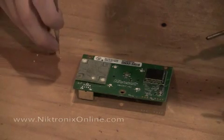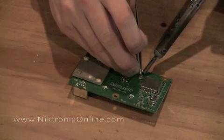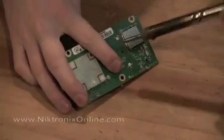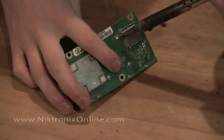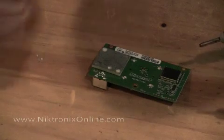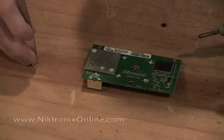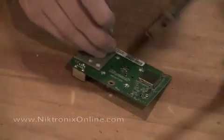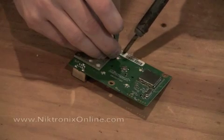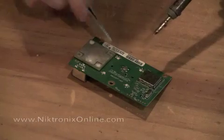Right there I was just using my thumb to tilt the LED up. This is why the 0805s are a lot better than the 0603s — they're a lot quicker to work with. Then on this last one, instead of soldering the outside pad first, I solder the middle one, just because this thing is in the way. It's what makes it easier.